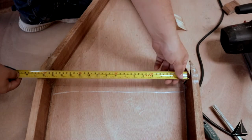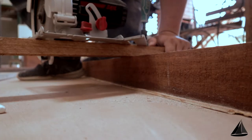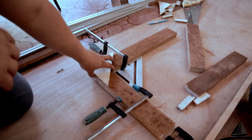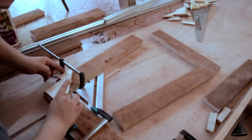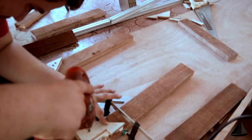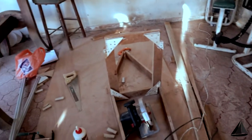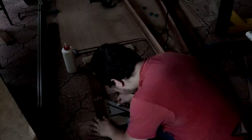To make the first two bulkheads, I measured the size of the lower piece of wood needed, cut the wood, and test-fitted the lower parts of the first two bulkheads. To help alleviate shear stress on the bulkhead, I cut some pieces of scrap half-inch plywood into a triangular shape with a cut for the chine — which in hindsight might not be necessary. Then I glued and screwed this piece into the vertical and horizontal pieces of the bulkhead, using a square to make sure everything was perpendicular. I continued this process with the second bulkhead to finish out the day.